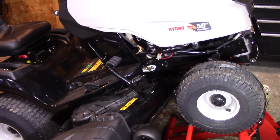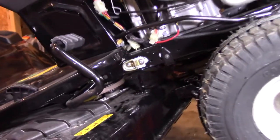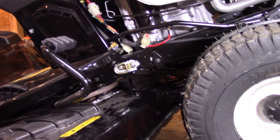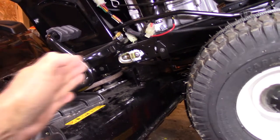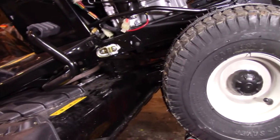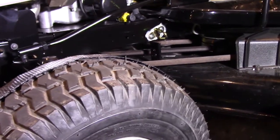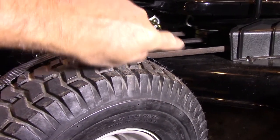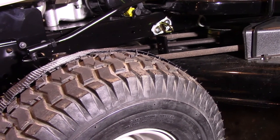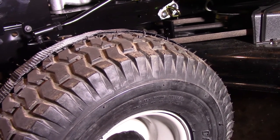This will give you a better idea of exactly where that particular location is that I used for the hold-downs. As you can see here, just imagine on your trailer you hook one hook up to there, it comes over and extends out to keep the load and the tractor towards the front of your trailer. That's an ideal spot because there is nowhere on this tractor to hook onto. I'll show you the other side — it's just a carbon copy. Your tie-down will come out to your trailer and keep the load in the right position.